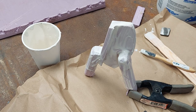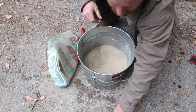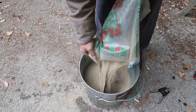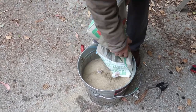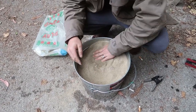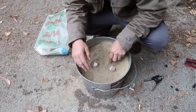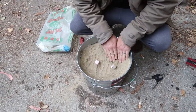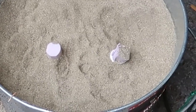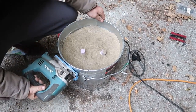For this next one I didn't want to use that green sand, so I got some more Home Depot sand — straight out the bag, a little moist but not bad at all. You can see I'm burying it up to the little risers at the vent, and I'm going to add two can risers with some Petrobond sand that I recently purchased. I'm using a little jigsaw to try to get some vibration in there to push the sand into the small voids — seems to work pretty good.